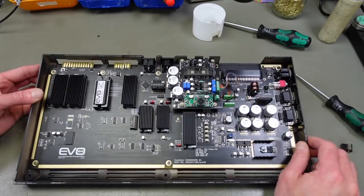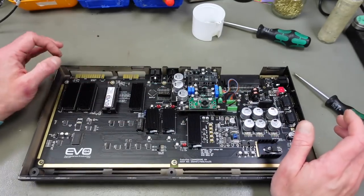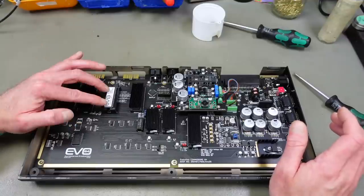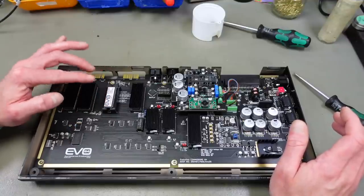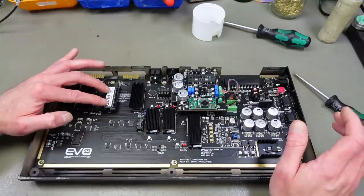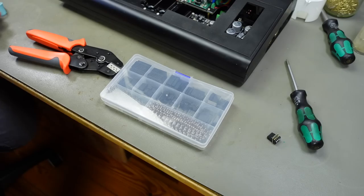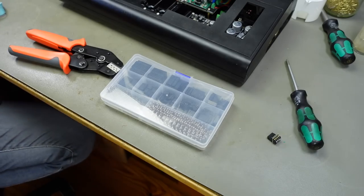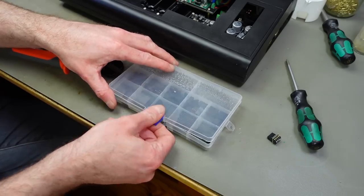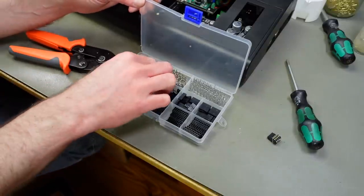Of course, you could add more switches, or like a Keyman works with this switch array, and you can switch to different banks of this multi-ROM, which includes a variety of kernel ROMs, BASIC ROMs, character ROMs, and cartridges. And depending on which EEPROM type you put in here, you can have a lot on there. And I'm going to just solder to the side on the top casing and crimp on little connectors on the other side to go on the pin headers.